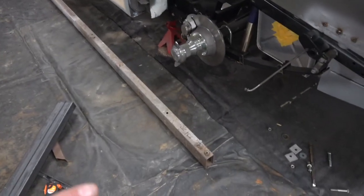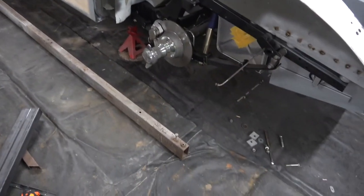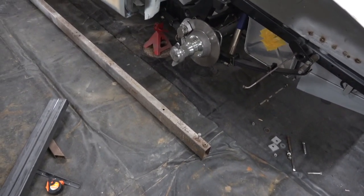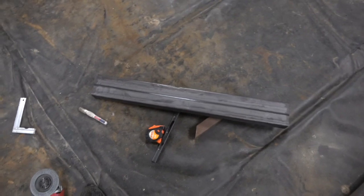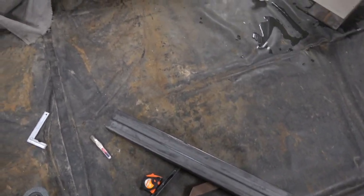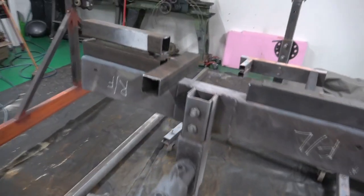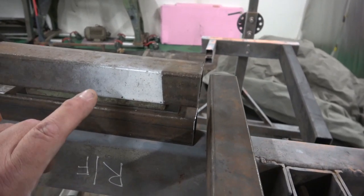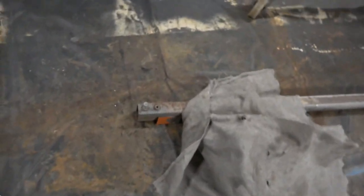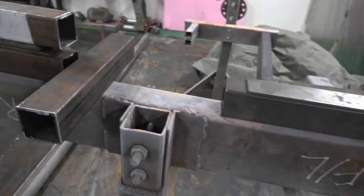These classic cargo bars are oblong bars fitted for an E-Type, but unfortunately they're not long enough to take the XK body and rotate it, so we have to extend them. I've got exactly the same material but 80 centimetres longer, and what we're going to do is butt weld these to the existing bars. We've made up slugs from 4 centimetre box section and offcuts, and these will slide inside the existing piece.